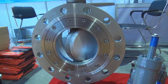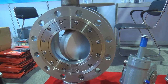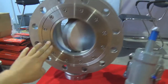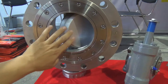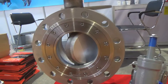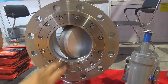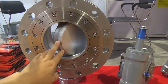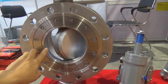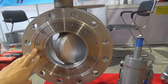Here is a triple offset butterfly valve. The special thing about this triple offset butterfly valve is we are going to use a seating face where the rings are not located on the disc - the rings are located on the valve body. The triple offset butterfly valve I already talked about before. When we are going to open this kind of valve, the disc seating face will immediately leave the valve seat seating face. So this kind of valve, when we open it, has no rubbing. So this kind of butterfly valve will have a long lifetime.